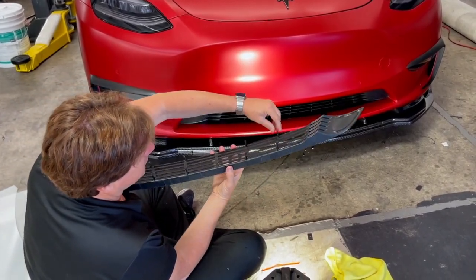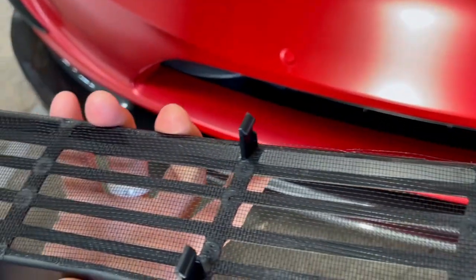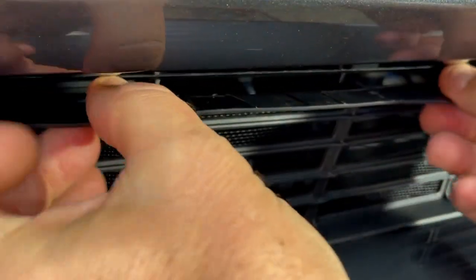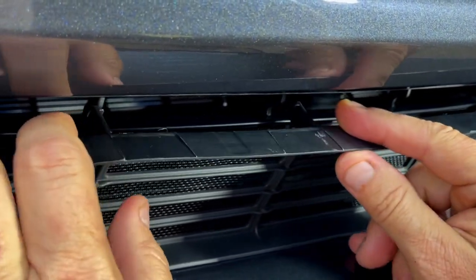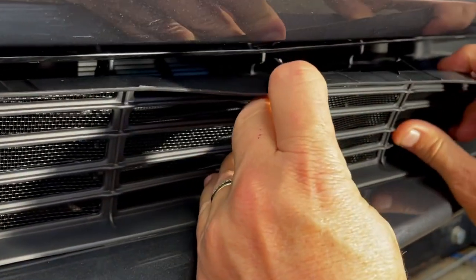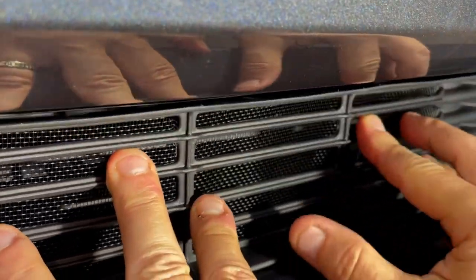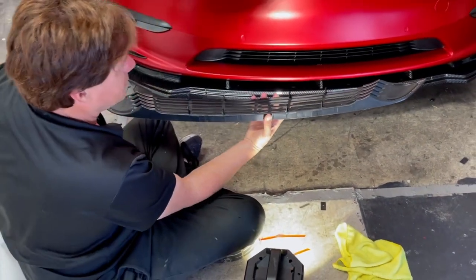And these hooks, if you get real close for a second, Rob. These four hooks are gonna grab on the inside of the assembly. So here's what's going on when you apply pressure. You're hooking these two hooks on the outside of these two posts. So it's gonna grab and catch like that. These are gonna do the same thing. This is gonna be on the left side with this hook facing in, and this on the right side. So when you press it in, it all locks in place for the louvers, so to speak.